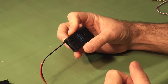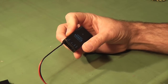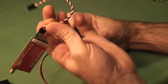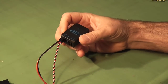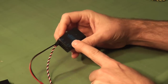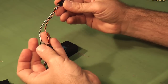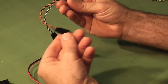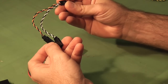The SBUS input is specifically for Futaba type receivers, but it also supports PPM inputs from receivers such as an Immersion RC Easy UHF, and that's what I'll be using for my aircraft. The cable for that goes into the SBUS port just there. The next connections are labeled as out - for the motor inputs they supply cables where one input goes to two outputs, so you can configure it in a quad formation with just one, or use both to go all the way up to a hex, supporting four, six, and eight type configurations.